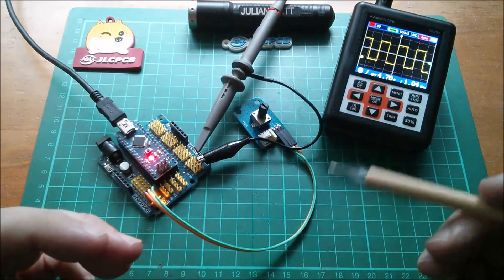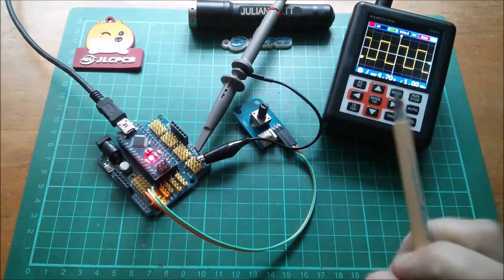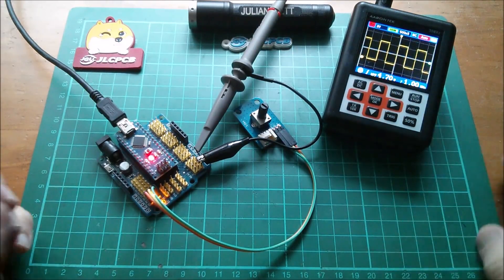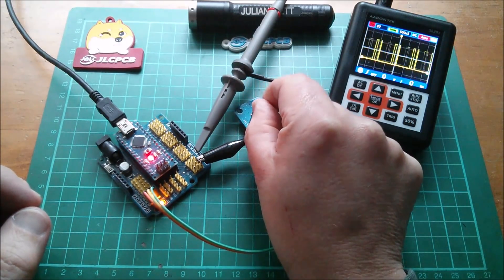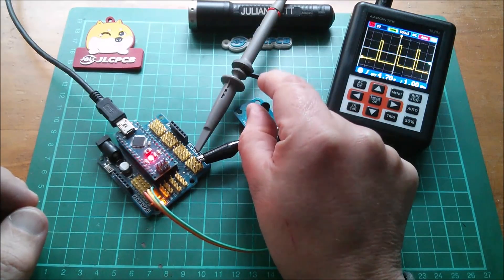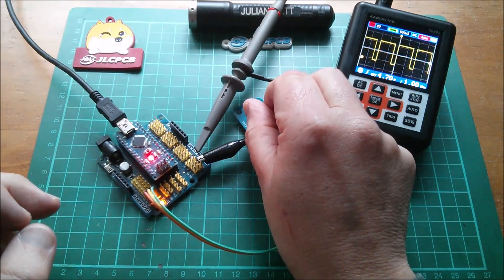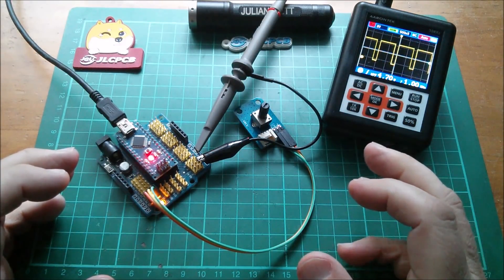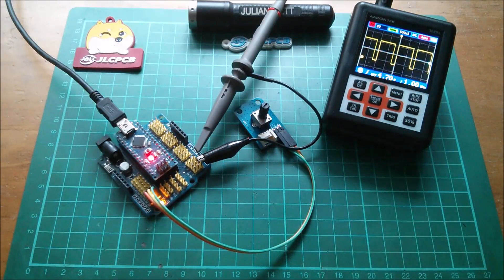I'll play with that value iteratively. I went for 0xF8 — and yes, that gives me exactly one kilohertz. The pot gives full PWM pulse width control over that one kilohertz square wave: even with a short mark and a long space it's still one kilohertz, and similarly at the other end of the scale. So with just a couple of statements we've managed to tweak the 490 hertz output on pin 3 up to exactly one kilohertz.